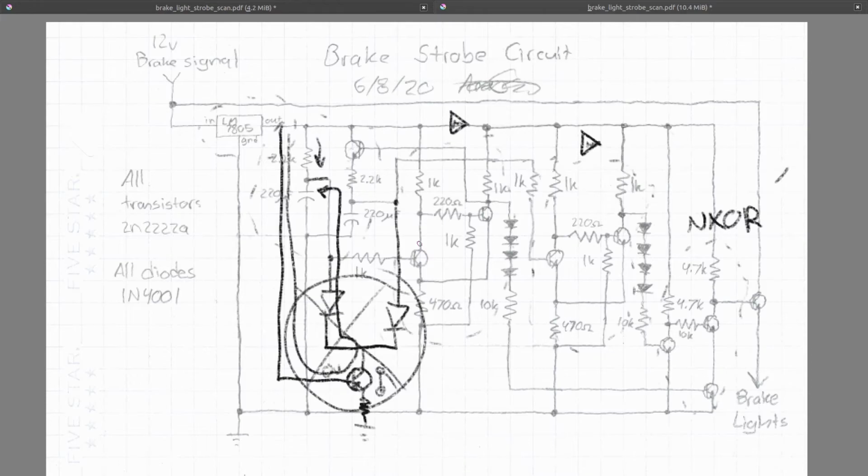One other thing that I ran into is because I don't really know how to build a Schmitt trigger from scratch, I had to look up kind of how other people do it, and I found a template circuit, but this template circuit has a low voltage of 1.4 volts, which is too high. So if I didn't have these diodes in here, then both of these would be high all the time. It doesn't drop enough voltage. 1.4 volts is enough to trigger a transistor.